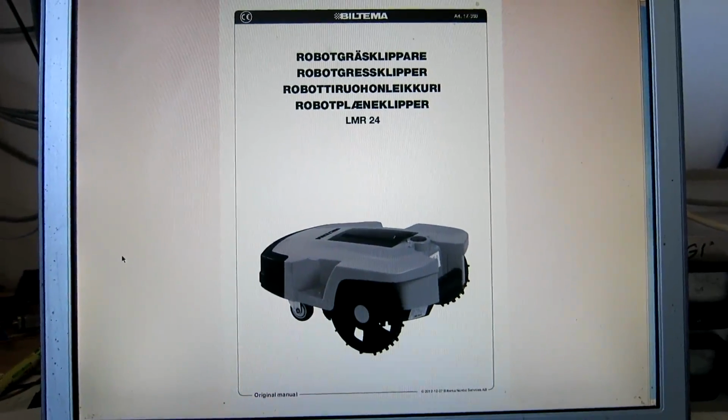What we see here is there is a carrier here, and it will now be keyed at 8 kilohertz, because the 8 kilohertz pulses that the blanker removes will remove the carrier periodically. So we get sidebands, 8 kilohertz on both sides, 16 kilohertz, and so forth.